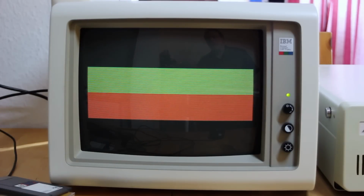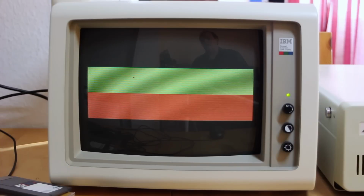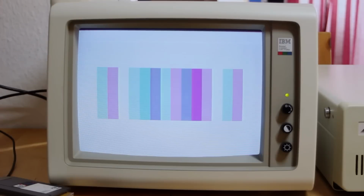I have a little program here which uses an improper mode, which is just a quirk of the IBM CGA. It just moves a little black cursor around, and on an IBM CGA card you'd expect to see it duplicated and sometimes disappear, but it doesn't seem to happen here. So they support this improper mode, which is really interesting, and deal with some of the bugs that were in the IBM CGA card.